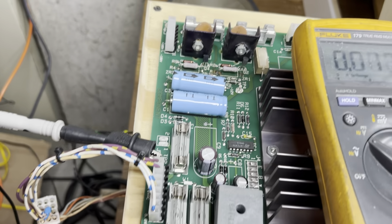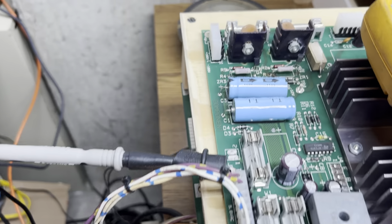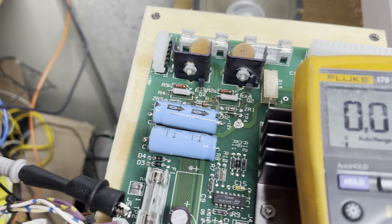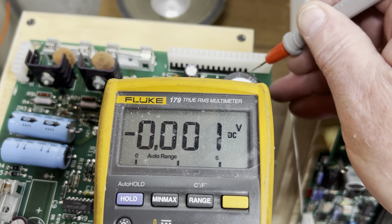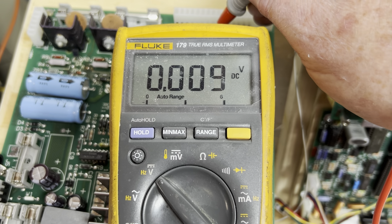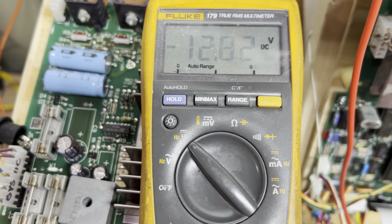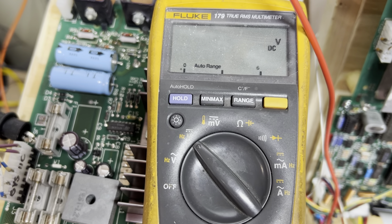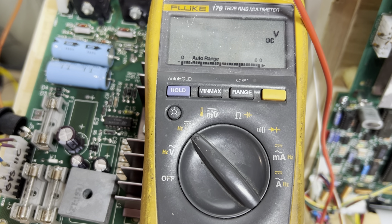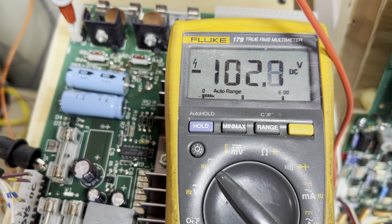This is an 11C MPU, and I built a sort of second story on my power supply box, which has just got stilts to hold up other than the regular System 11 power supplies. This had a problem with one of the negative voltages — the negative 100 volts was off. Here's the minus 12, so that proves all of those. There's the plus 100. I put these headers on there to keep myself from shorting pins together inadvertently and ruining my work.